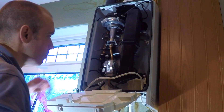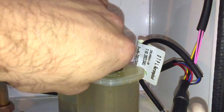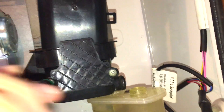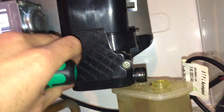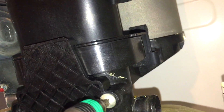I'm going to show you where the actual defect is. First I'm going to take this little rubber connection between the trap and the sump off. The fault is above this, which I'll show you in just a second once I've made access. First you've got to remove these two screws — this is where the fault is. It lies behind this cover and 9 times out of 10 engineers will incorrectly diagnose it as being a leak from this cover. Just above this right hand screw here, you can see the white staining on the sump.